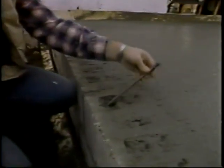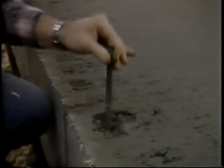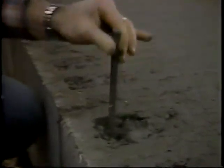Well, what else do we have to do? One more step is to put the anchor bolts in. Let me come around and talk with you. Okay, I'll show you how that's done. Basically, you have to do it while the cement's soft like this. Do you absolutely have to have the anchor bolts? Yeah, you really have to have them. It's required, and it helps to hold the walls not only from moving in and out, but from blowing off in a gale.